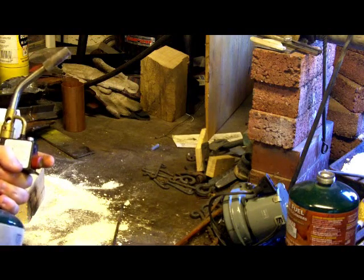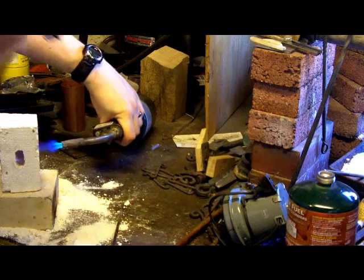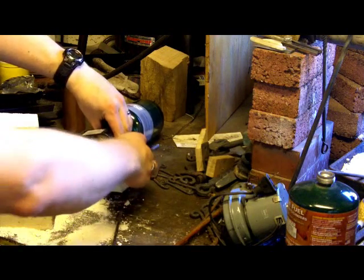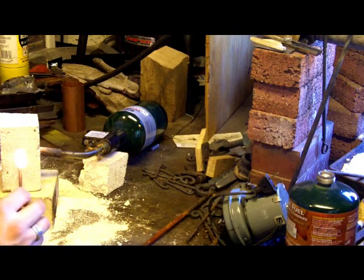Any plumber's torch will do. This one used to have the piezoelectric automatic start, but anymore we need to use the little striker. Put the opening inside the burner port. Lucky for us, we happen to have a couple pieces of brick to rest that on. And you can see immediately the inside of the forge is glowing an orangey yellow, which is a great temperature for most blacksmith forging. It may be a little hot for knife work, so you just have to keep an eye on that and be extra careful. Take it out when it's getting red — it's sort of a dull red color.